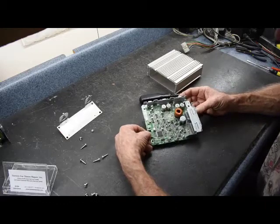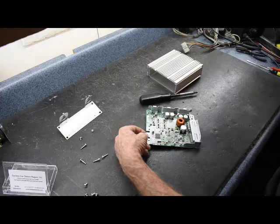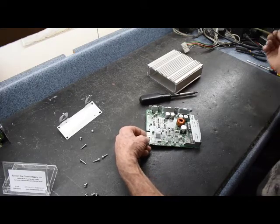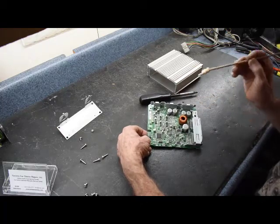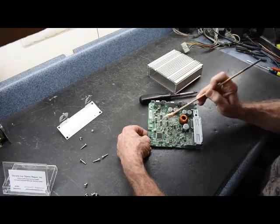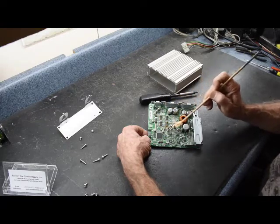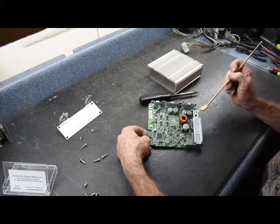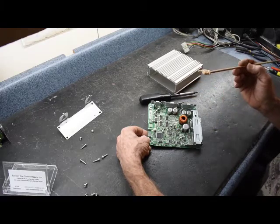The problem here, we've been through this amplifier, we've checked the components in it, and the problem with it is all the electrolytic components here through the entire amplifier, they're either right at specs or below. So we're going to replace all these components, make a map of them first, check their values, check the polarity of each component.